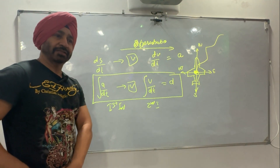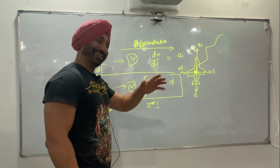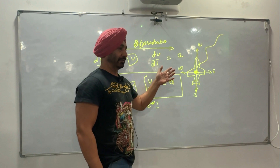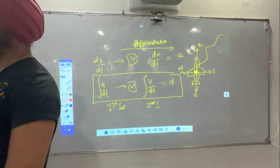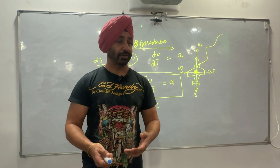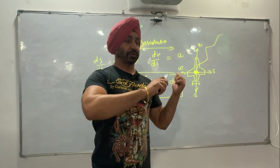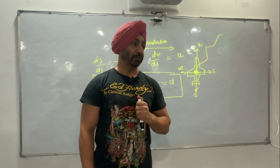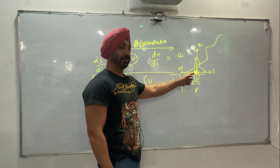You get it — how simple this equipment is. You just put two accelerometers minimum and they start measuring acceleration. You give the starting position, they start drawing a straight line distance. The most important thing is giving the initial position. It also shows you ground speed because you are moving on the ground. Your TAS comes from ADC plus your ground speed, because this system is giving you your ground speed. So if you put TAS input, it will give you wind also.